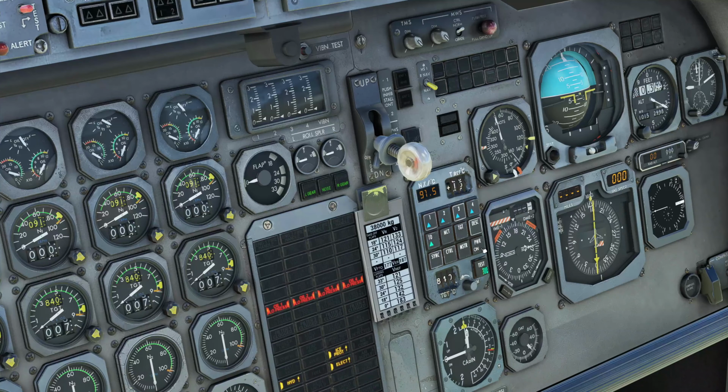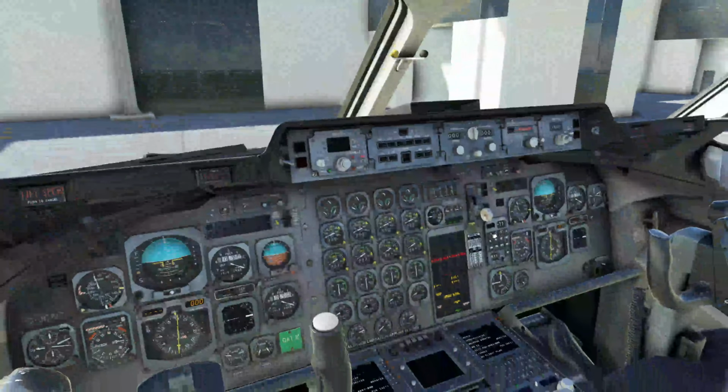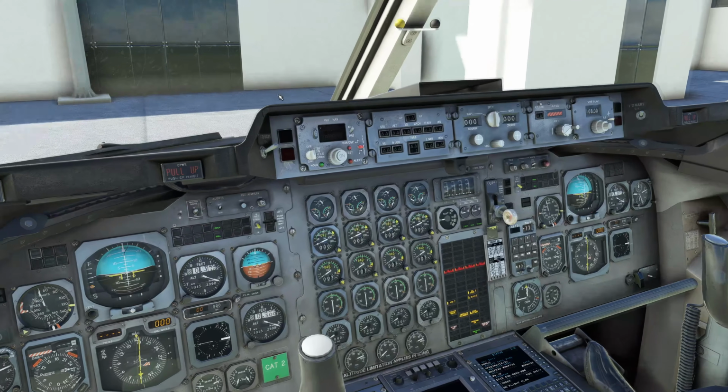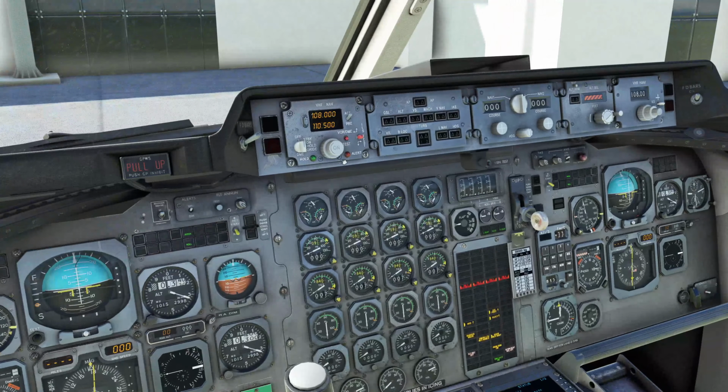And now that that's all done, we're going to turn off the thrust management system because we don't want it to interfere with the engine start when we get there. So now we're going to get the navigation side of the house set up. So the flight directors for the 2 sides can come on. The flight directors are up. The Nav1 radio is here. We're going to push the button for on. We're going to turn this DME switch to on, and then it will do a test.